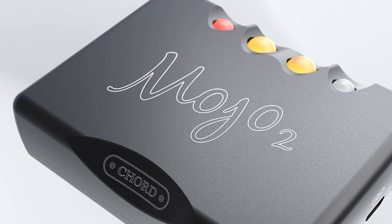The frequency response curves that informed me on how to do the DSP were really about the straightforward frequency response, and in particular the low frequencies. The DSP that we've got will tune out low frequency problems. It's not going to do a great deal if you've got a resonance at 9.52 kilohertz; there's nothing that this EQ will do for that. It's a broad brushstroke approach, so that you can just tweak the sound to suit rather than specifically trying to get rid of individual resonances.